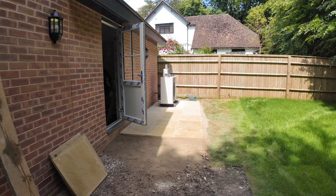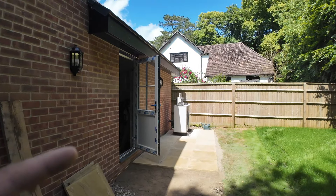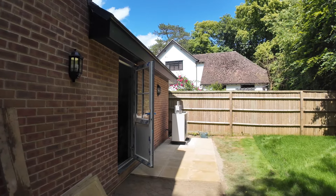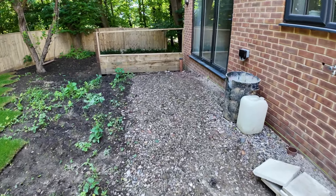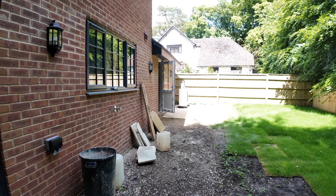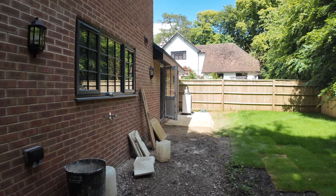So there we have it. I've got an eighteen hundred width — three slabs — which makes eighteen hundred. I want a fifty mil margin just off the house, which I will shingle. We had a right load of messing about down the end there cutting round the storm drain and the air source heat pump slab. Now we're just coming down this straight run. We finally got it back square and we've just got to come back down here. Probably need about another ton of stone, maybe a little bit more. Fairly happy with the patio height. Just trying to save a few pennies because costs are mounting up and I need to exit this deal rather soon.